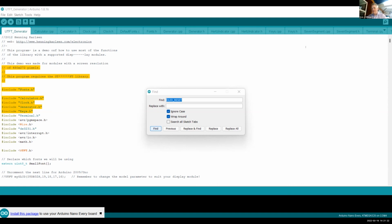There's a lot of boards out there, and you can spend a lot of money. Part of it is that every manufacturer kind of wants to make their own board, and I know SparkFun has a SparkFun Red, which might be Arduino friendly. My feeling is if you're getting started, just get an Uno or a Nano and get started. It's great. Then the point is, do you need to upgrade to a bigger board? You find that out by trying some projects and seeing, are you running out of memory? Is it performing fast enough?